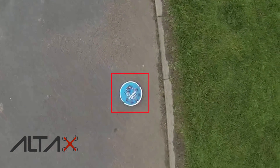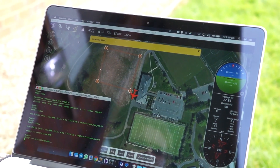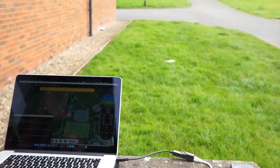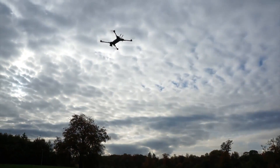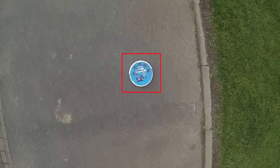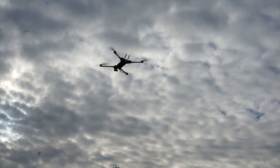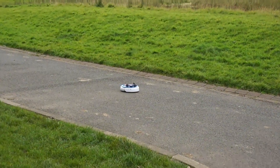That information is the X and Y position in pixels, which we then translate into velocity commands in order for the vehicle to move and center the camera — center the vehicle — on the target, which is the Roomba. This is basically something similar to a missile, except that the drone never gets close to the Roomba, only when landing of course.